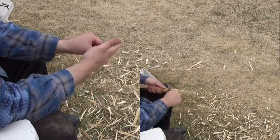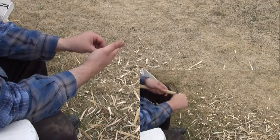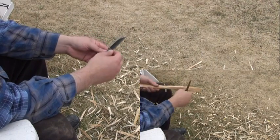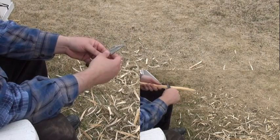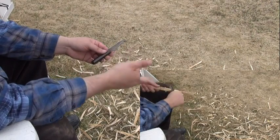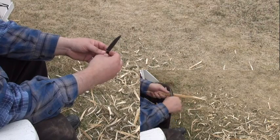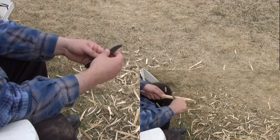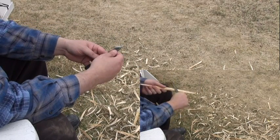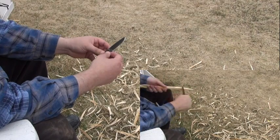It's a full round and it's extremely comfortable. The blade is blued, which is essentially your darker form of rust — relatively stable compared to the orange form of rust. Orange iron oxide increases in volume as it forms, so it pushes off surrounding rust and steel. Black oxide doesn't do that, so it forms a relatively stable protective coating.